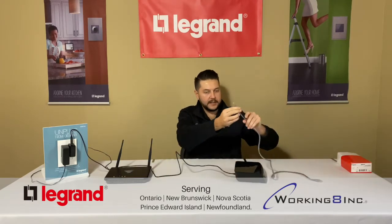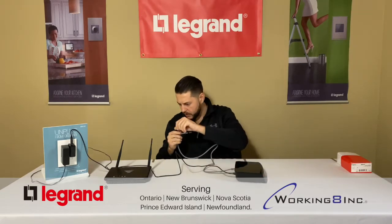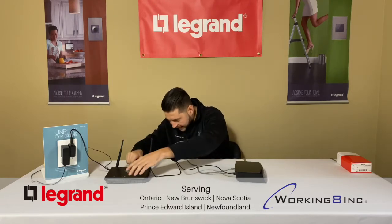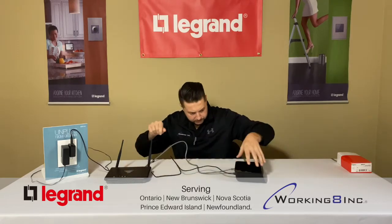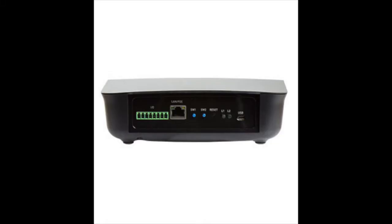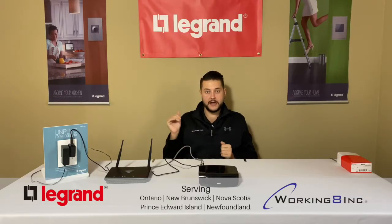and then you plug the Ethernet into the back of the LAN port and into the back of any of the LAN options on your router. And once the LAN light starts to flash on the hub, you know it's all connected properly. So the hub is now all powered up and connected, and you're ready to start adding your lights to your system.